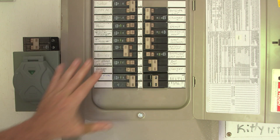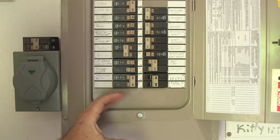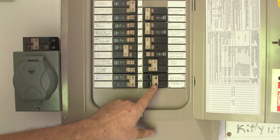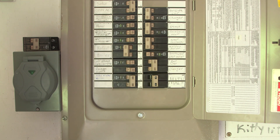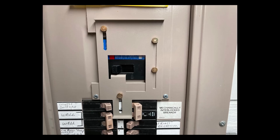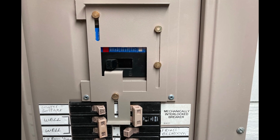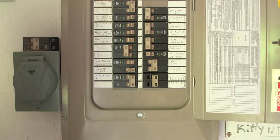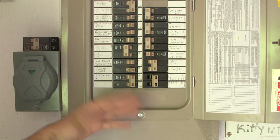But likewise, if we're using this we want to make sure we can have this breaker on and the main breaker off, so we're not accidentally sending power back out to the grid through a transformer and kill some poor guy who's trying to fix a blackout. Unfortunately on this particular panel, this is a sub panel that is main lug only — that means it doesn't have a separate big input breaker. The 100 amp main breaker is just in line with the rest, just your normal branch breakers. That means I can't just use a common type of disconnect that's designed so that a certain breaker can only be on when the main breaker is off. They just don't design them for this, and in some ways rightly so because this is a sub panel — you really want this normally done at the main panel.